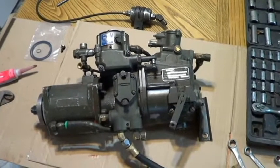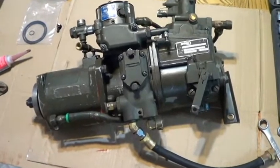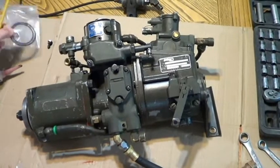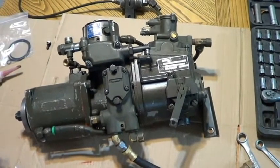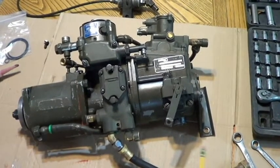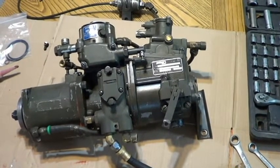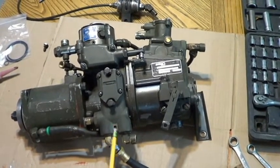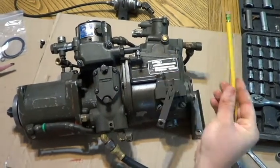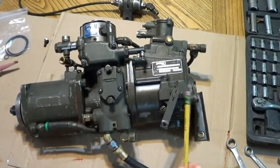We're covering a PSB6A injection pump off of the M35A2 deuce and a half. I'm going to go through and put an O-ring kit on it. We'll go over some of the features of the pump. You've got a lubrication point, front drive. This is your fuel pump on the pump that boosts the pressure. Your transfer pump in the tank pushes fuel up to this pump, pushes it through your fuel filter system, and then it enters over here on your fuel compensator. This is the fuel shutoff, and then this is your throttle linkage. So that's the basic parts of it.